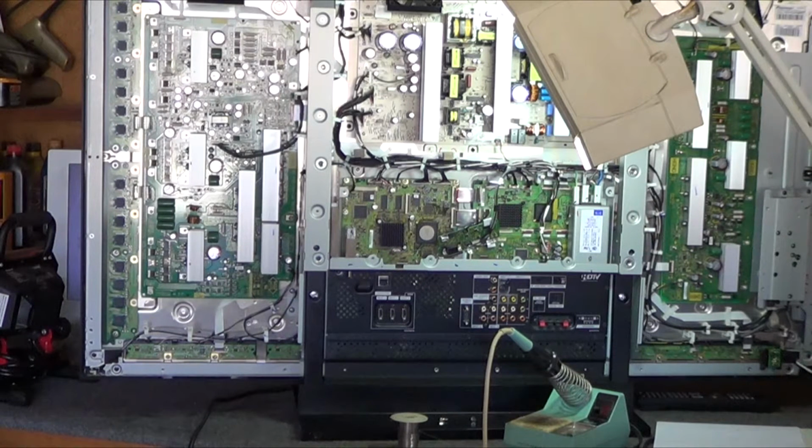Because I'm a computer engineer and I'm used to looking for different things like motherboards, the BIOS will beep at you trying to tell you what the problem is. 2 beeps means maybe no video present, so on. So I was looking at the front of the set and realized the power LED on the bottom left of the set was blinking. And counting it, it was repeating 8 blue blinks.